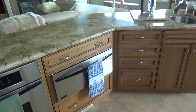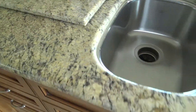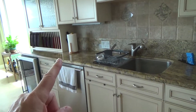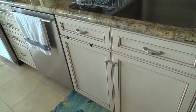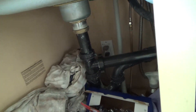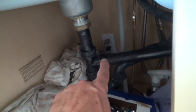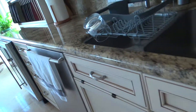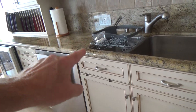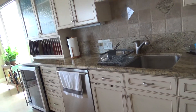This particular kitchen has an island, and there's another garbage disposal right here. My assumption is that both garbage disposals are connected on one dedicated circuit from the electrical panel. They've probably run the power down below where you plug in — there's a plug way back in there. There are two different things plugged into that outlet: one happens to be for the dishwasher. There could be two different circuits going into that electrical outlet.